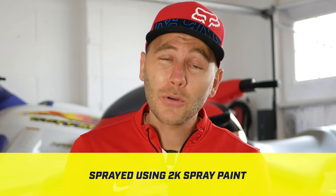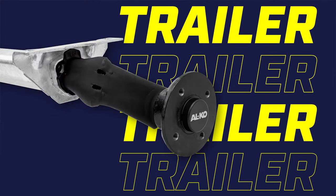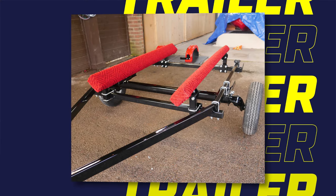I can vouch for this. I've had the XPDI trailer, this one behind me, powder coated for the last 3 years, and well, the only bit that's actually peeled or become compromised is the axle, and that's because the axle wasn't powder coated, it was automotively sprayed. You can't powder coat axles on jet ski trailers. They typically use pressed rubber inside of the axle itself, which, well, if you put it in the oven, it would melt. It's rubber. Therefore, your only choice is to either automotively spray it, to color code it, color match it, which is what I've done because I'm a nerd, or you leave it exposed because you obviously can't powder coat that specific element.